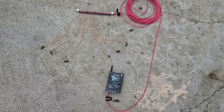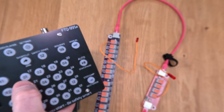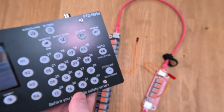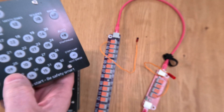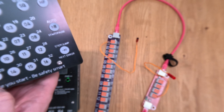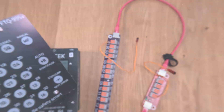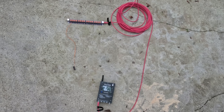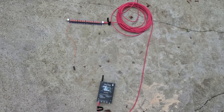As demonstrated, under this particular setup anything less than a two second impulse failed to ignite the talon. For test seven, the FireTech controller also allows you to manually fire channels, but this is only configured for e-matches due to the short impulse time it produces. I wondered if pressing the manual fire button repeatedly in quick succession could manually fire a talon. With a single talon connected to a rail on a 20 metre cable — after nine presses of the manual fire button, the talon did actually ignite.